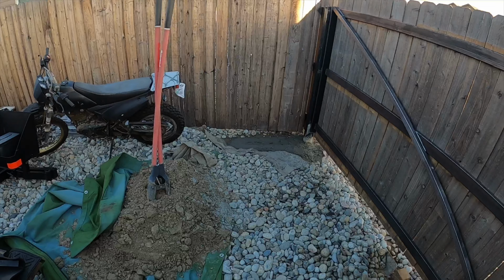We're going to leave it on here and weld it out in place just to help with the warping. And then another thing we'll have to watch out for is if we were to weld this and this, those welds would then hit and the gate wouldn't close properly. So we're not going to be able to weld here or here. We can weld over here for that 1 inch where it doesn't meet up, but we can't weld in here or there. It's a tight fit, so. But there'll be plenty of weld everywhere else and on the other side.